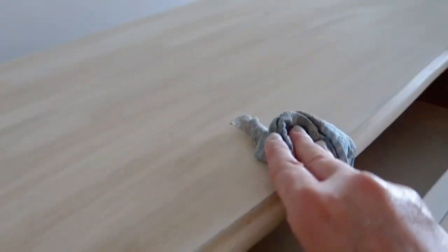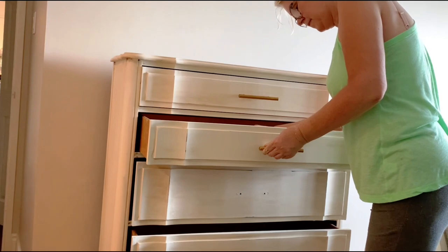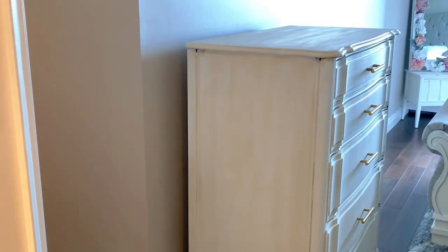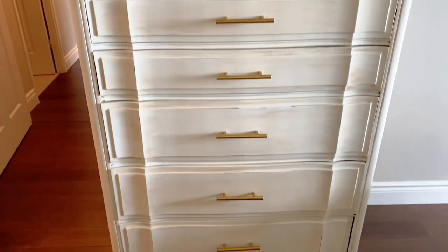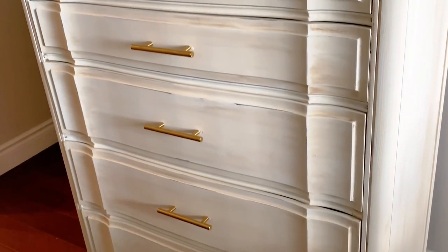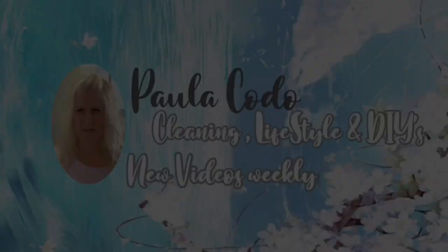To finish the project, you're going to add a top coat. I use this top coat and it dries clear, so it's not going to yellow or change the effect. Then I changed out my hardware to gold hardware just to create a more modern look. And this is it — I created this beautiful wood look using chalk paint, and I can't believe how beautiful it looks. It truly looks like white oak. I'm so pleased with this. I'll be updating the rest of my white painted furniture in future videos, so I hope you come back for that. Thanks for watching!